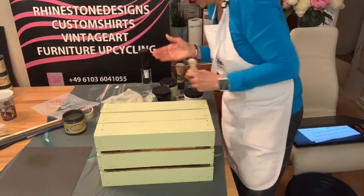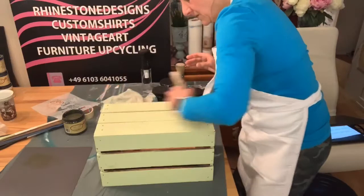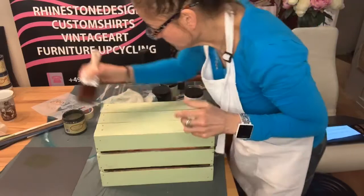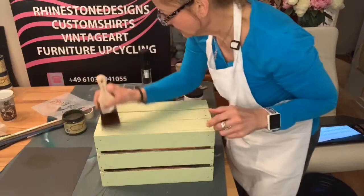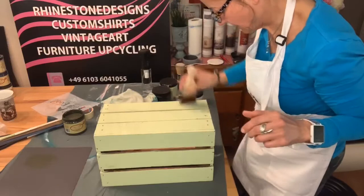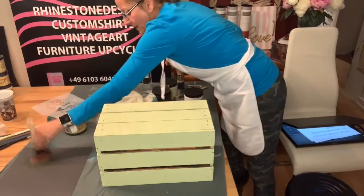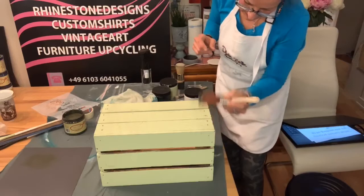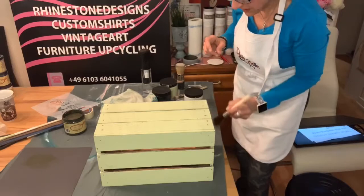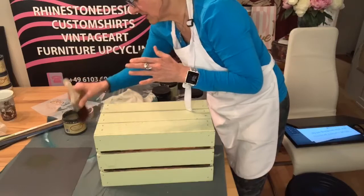You can do that as heavy as you like — you can go across if you want heavier streaks on there. I just like to enhance the wood grain a little bit. You can see that all the high points are taking up the paint. Go around the corners like this. When you do dry brushing, you are basically enhancing the high points. When you do waxing, you're enhancing the low points — you put the wax on and wipe it back and it stays in the low points. With dry brushing, you're enhancing the high points.